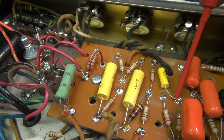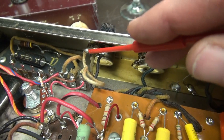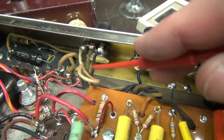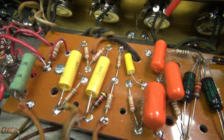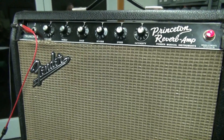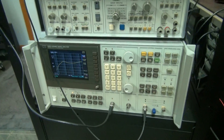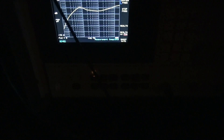The update is complete. The cap is removed and I put a jumper across the intensity pot — now the bias goes direct. That pot does nothing and the tremolo circuit is disabled. Power back up, go back up to the spectrum analyzer, kill the shop lights, let's see what she does.